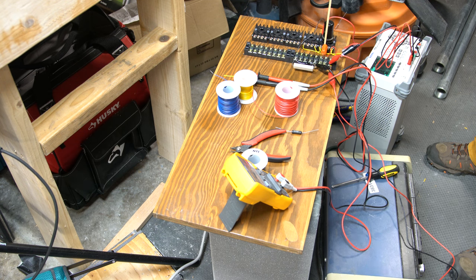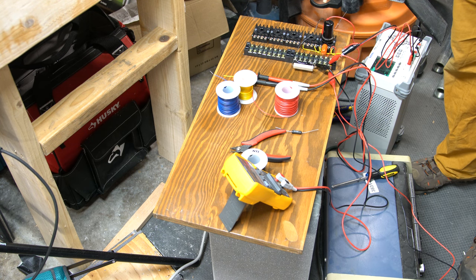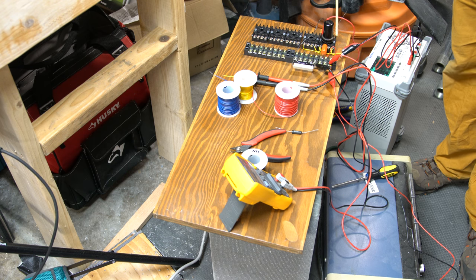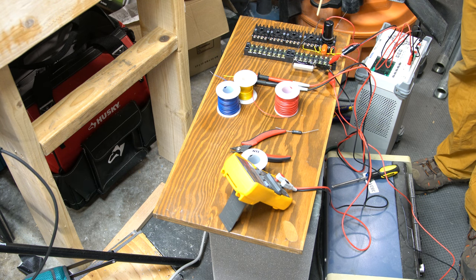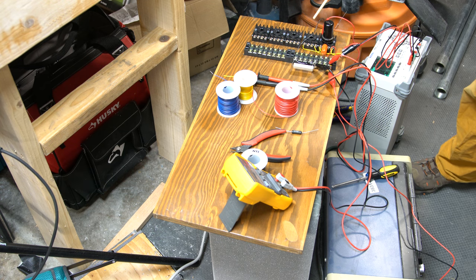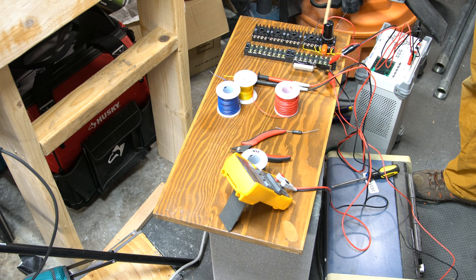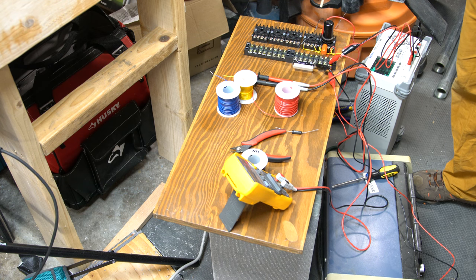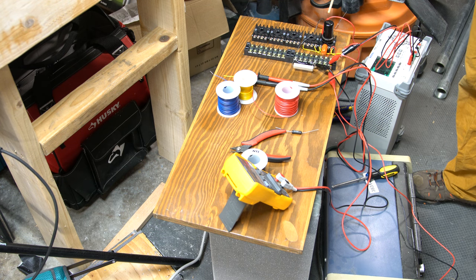This is a straight high voltage input — 300 volts. Outside of the coupling capacitor, I connect to the load, which is an anode resistor that goes to ground. The data sheet says you should try about 720k, and I only have 860k, so I'm giving a little more load than it would want. Generally you have some variance in your load as long as you're within a tolerance range.